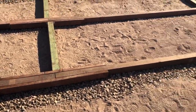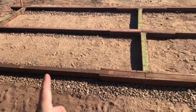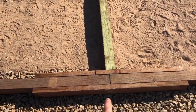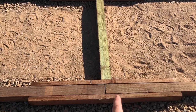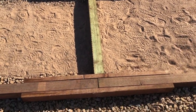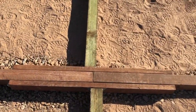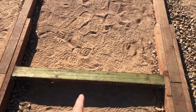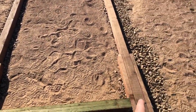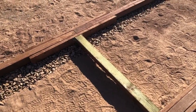I also want to show how I connected a 12-foot 4x4 and a 12-foot 4x4 to make a 24-foot 4x4. I used treated 2x4s cut into 4-foot lengths, placed across that seam and screwed in a bunch of times. The middle crossbeams are three inches shorter than the outer crossbeams because of that extra 2x4 on each side. That's my connection point to make one long skid out of two.